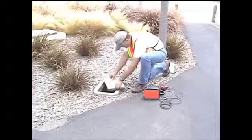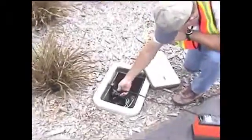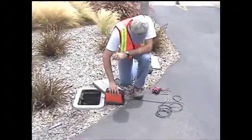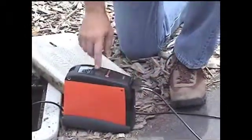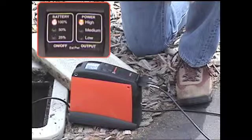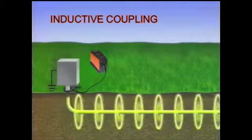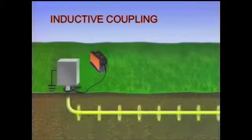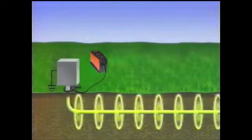If you are using the inductive coupling method, first make sure the transmitter power is off, then position the Metro-Clamp around the conductor you want to trace, using the smallest clamp size that will fit around your conductor. The closer the clamp size is to the conductor, the stronger the signal will be. After hooking up the Metro-Clamp to the conductor, connect the phone plug to the output jack of the transmitter. Turn the power on. The battery and the power output LED indicator will flash simultaneously. In the inductive coupling method, both ends of the target conductor must be grounded to ensure a return path to the transmitter for optimum signal strength. Power lines and telephone sheaths are generally grounded, but gas lines often have insulators. Use a jumper cable to temporarily bypass the insulators.